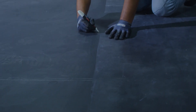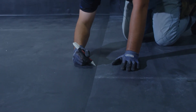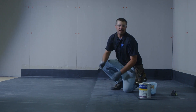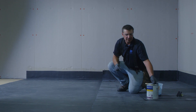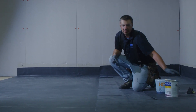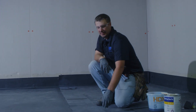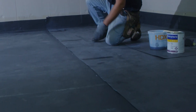I'm putting my mark just outside of where my seam tape goes, so my seam tape will stay just short of this mark. Once we have our seam marked, the next step is to begin installing our primer. We've added a few tack backs here with primer so we can fold the rubber back to make it easier to apply the primer.